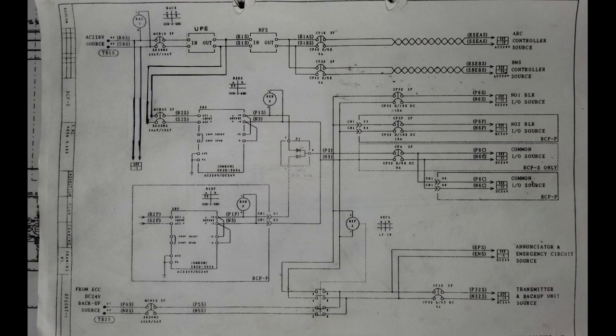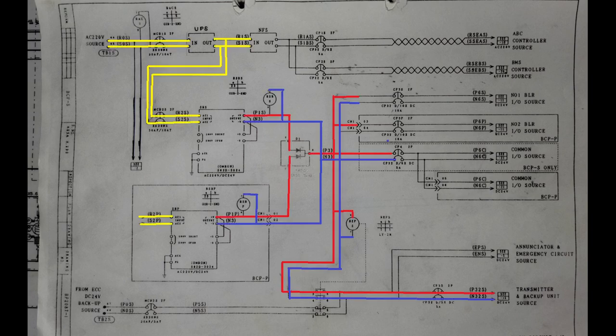Let's analyze the operation of the electrical circuit. In normal condition, 220 volts is supplied through the UPS to the main power supply unit, then 24 volts power is supplied to the control and alarm circuits, and auxiliary relays are energized. When the main power supply unit failed and the circuit breaker tripped, the relays de-energized, causing the corresponding alarm. However, the boiler continued its operation because it was now powered through the main power supply unit of the starboard side boiler, as can be seen from the diagram. Diodes are needed for safe operation of power supply units in parallel.